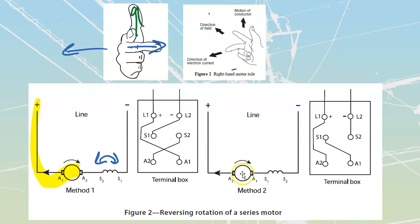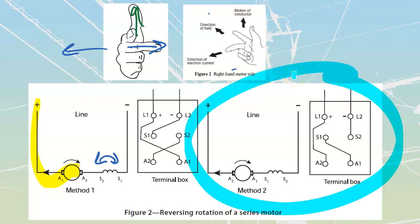The other method is to reverse the armature connections. They show that in the terminal box they've reversed the armature connections, and when they do so it changes the direction. Method two here should really be what they start the whole learning task with, because it's the same direction of rotation as all previous learning tasks. It's unfortunate - it's a layout issue in these modules that was never caught in time and causes unnecessary confusion. When you're studying for midterms, your interprovincial exam, use figure two as your main method.